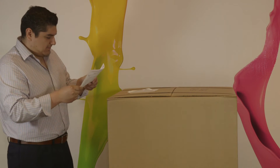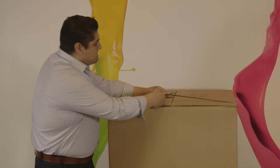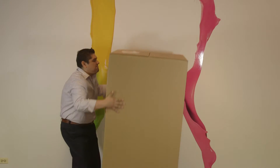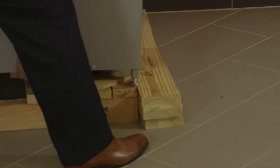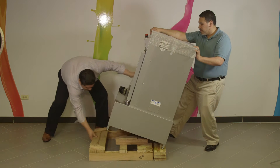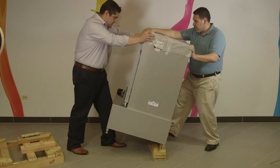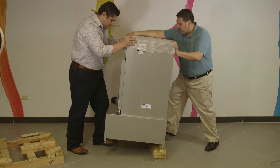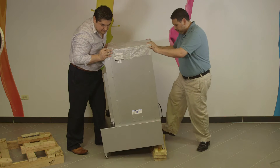Located on the outside of the box are the instructions for unpacking the mixer. Read the instructions before setting up your mixer. Remove the shipping carton and brackets that attach the mixer to the skid. Then slide the mixer onto another skid or a block of wood, and slightly tilt the mixer back. Remove the skid and gently set the mixer down. Don't tilt the mixer back too far, otherwise the super struts could separate, causing damage when the mixer is powered on.